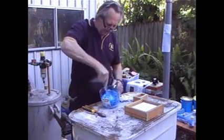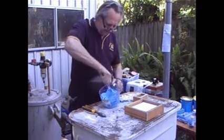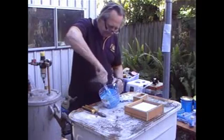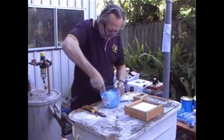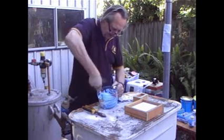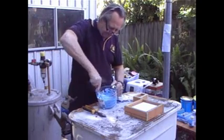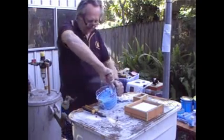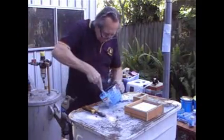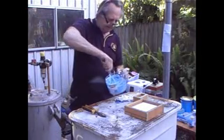Try not to fill it all up with bubbles because they don't tend to rise too well in this stuff. This is where you could use vacuum to get rid of the bubbles once it's mixed. Although it doesn't seem to be generating too much in the way of bubbles, as long as you're careful when you're stirring it. The advantage of this silicon is it has a blue dye, so you can see when it is actually mixed. The product I use is white, and I actually add green dye so I can see it, because I had troubles the first time. Alright. I reckon that's enough.